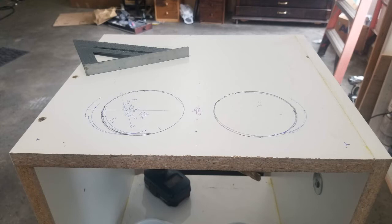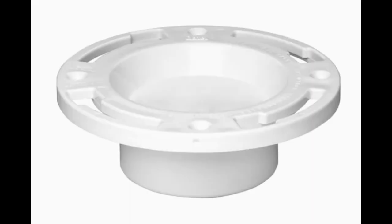This helped me decide the overall size of the system — essentially a 16-inch rectangular cylinder. I used white melamine shelving boards, which were just under 16 inches, at 15.75 inches wide. The four sides of the boxes were assembled with butt joints held with glue and screws. I do not use complex finger joints or anything else — this has worked well for me.